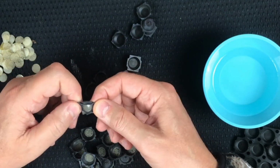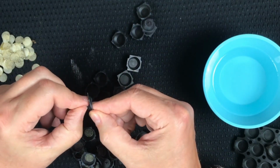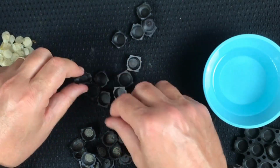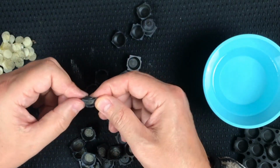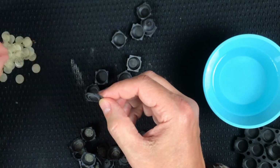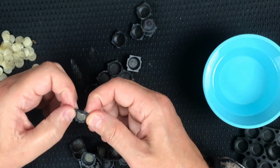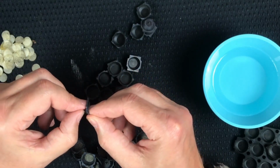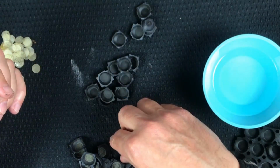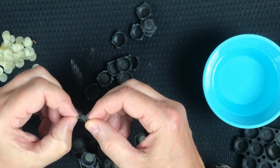Of all these Brother dome and foil ones that I've watched videos of, the foam is just gone. You can't tell what height it used to be. Whereas with the Keytronics, I actually got 3 of the same lot at the recycler, and there's definitely ones that haven't disintegrated, so I can see the depth of the foam, and it matches the stuff I ordered from TechSelect. TechSelect also says this has successfully worked with a bunch of keyboards, but they didn't name Brother foam and foil, so I sent them a message on their website, but they didn't answer.